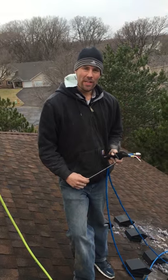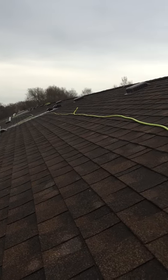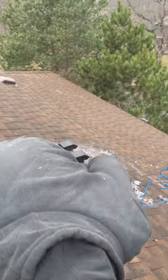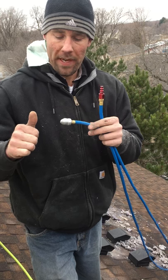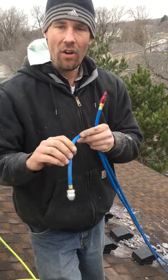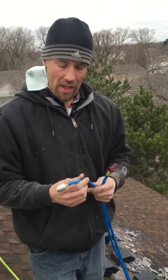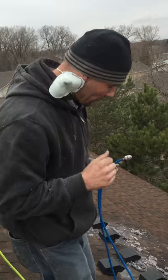Notice we're on a three-story building, and today we're performing the dryer vent cleaning on all 30 units. We use this tool, which is a high velocity reverse spinning ball that spins around in a circle and works its way down to the bottom of the dryer. Then as we pull out, all this stuff comes flying out with it. This is a specially made one, 40 feet long, to reach the longest drops on commercial projects.